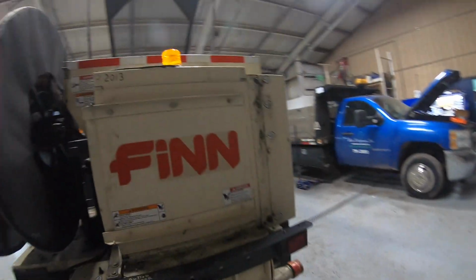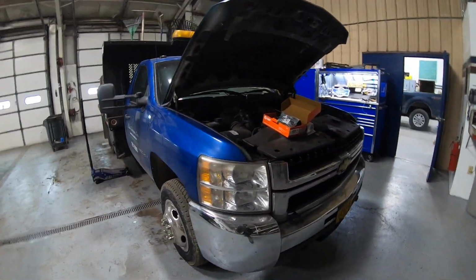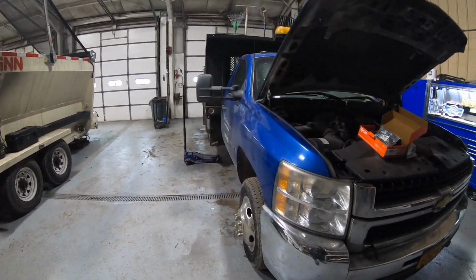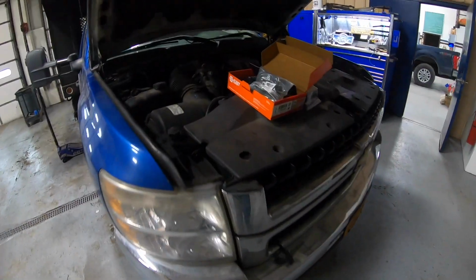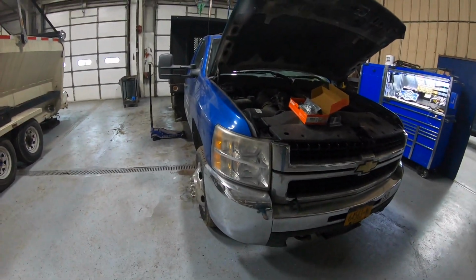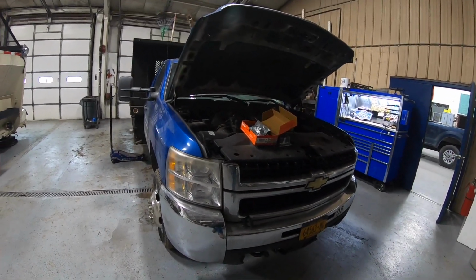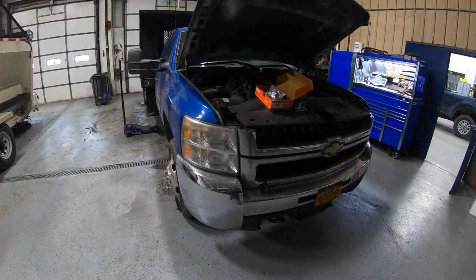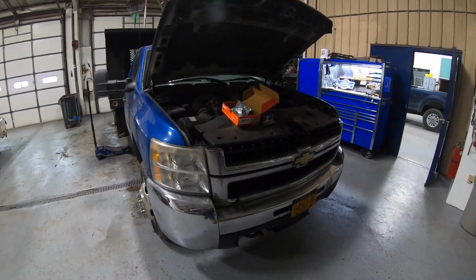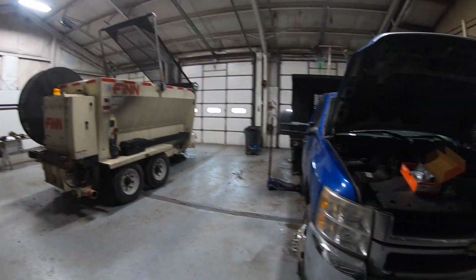But got my blinky light on. Chevy back in the shop again, all sorts of problems. Rear brakes lasted 6,000 miles on good Napa fleet pads. Those are the fronts. So that's not good. I'm trying to figure out why that's doing that, if the master cylinder's not letting the fluid back through or what the problem is. But I got front brakes to do. I got the backup alarm to do. I got to pull the drive shaft out, put a U-joint in it. I got one up there. All sorts of stuff. So, another busy week here in the shop.